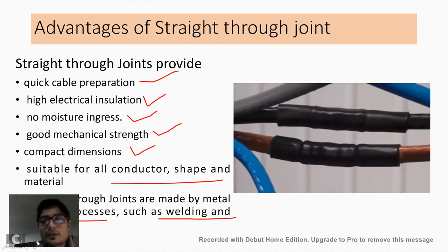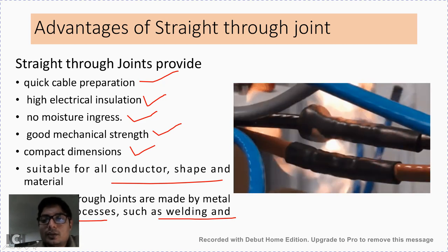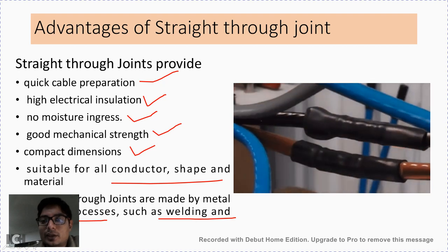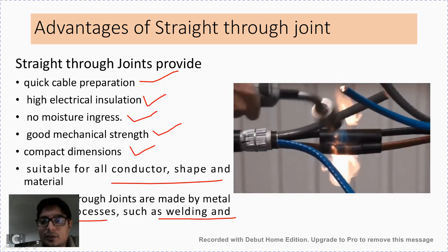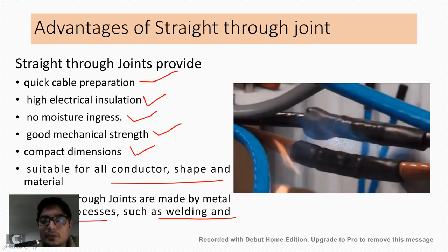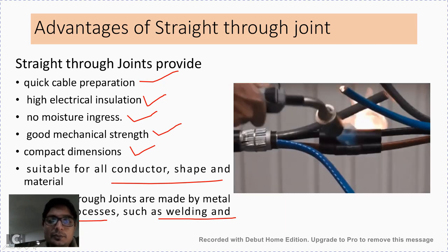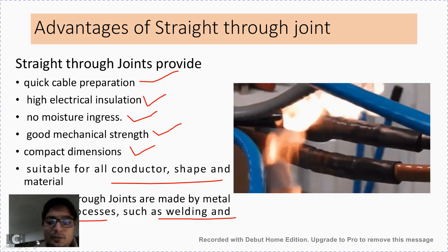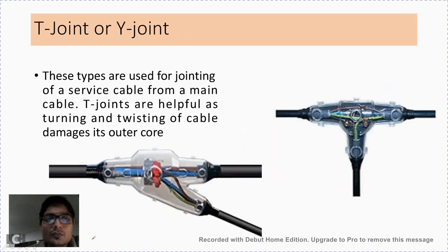An animation shows how joints are prepared: first, heat shrinkable tubes are placed over individual conductors and heated to shrink to the size of each conductor. Then the bunch of conductors is heated again and another tube is placed over the entire bunch, forming the size of the same cable. That is then enclosed in the plastic net and the process described previously is followed.